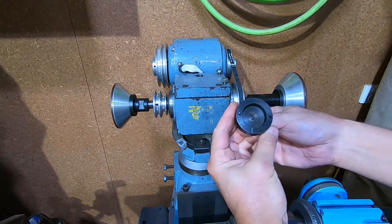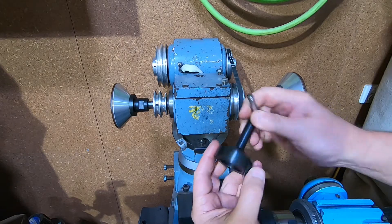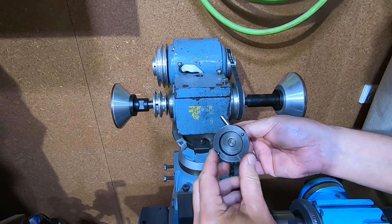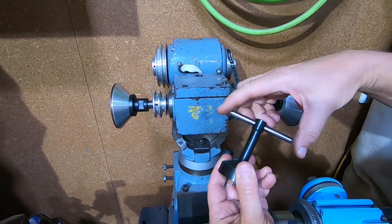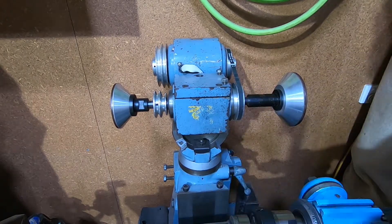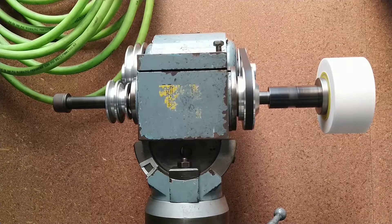These were fairly simple turning exercises to make — took a piece of bar, turned it out, drilled for the pins, threaded and held in with Loctite, and cross-drilled for a bit of round bar for a hand grip. That's it. So these are all the pieces I made for both arbors after they were blued. Both arbors have very little runout and I'm quite happy they'll be good enough for the job.